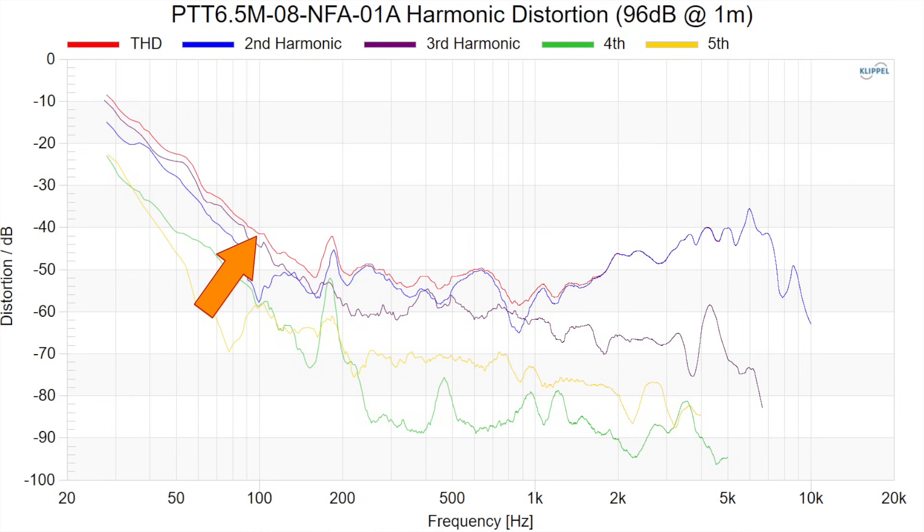I don't talk about my subjective thoughts on speakers because when reviewing a drive unit by itself, saying I heard X, Y, or Z goes right out the window as soon as you put it in an enclosure, mate it to a tweeter or waveguide, or add a crossover. The best thing I can do is provide you with the data so you can pull up a modeling program and model the best enclosure, baffle, and crossover configuration. Looking at harmonic distortion, it's below 1% THD until about 100 hertz — around negative 50 dB for most of the range — and a crossover will drop some of that low-end harmonic distortion as well.